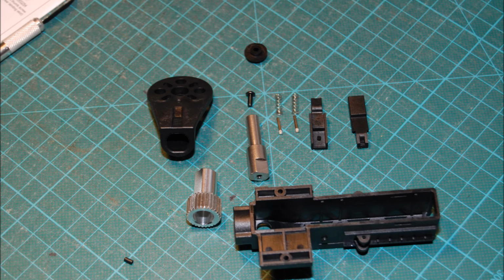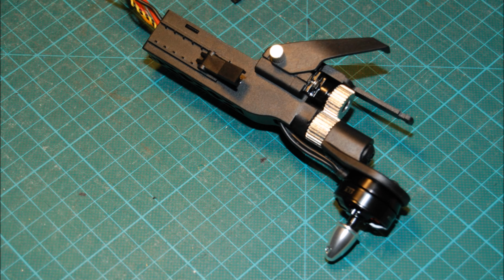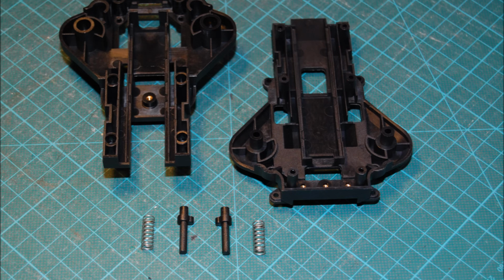That's the gear selection at the back, and then we go on to installing the servo for the back. I had a bit of a job with this because the gears were seized and I had to take a file to it and reduce the size down, but it did work in the end with a little bit of grease on it. The ESC fits nicely inside the arm, and I've also taken through the cabling for the video transmitter here. So you've got video transmitter and 2 servos coming back.